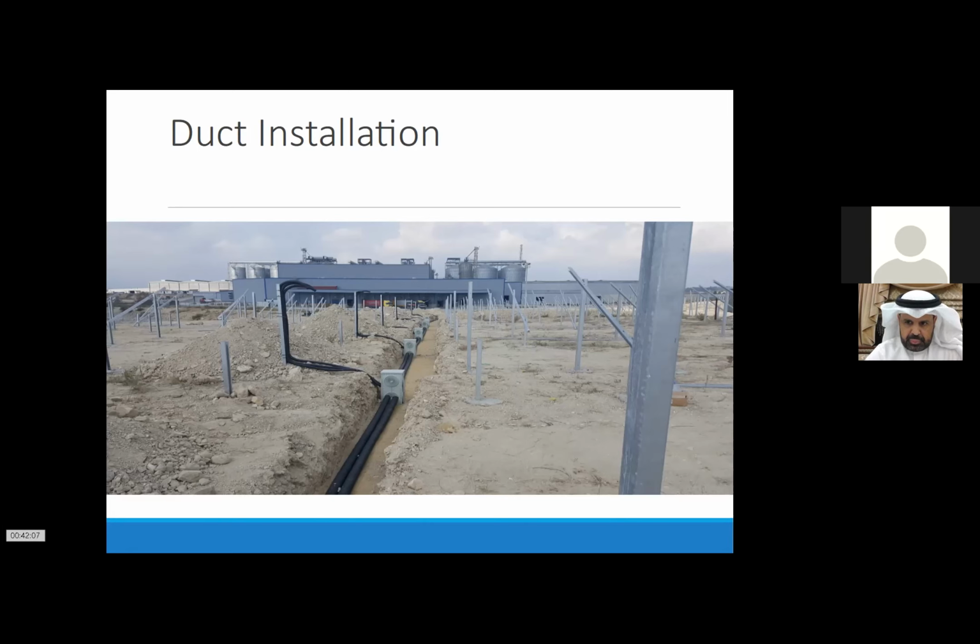So that's a similar question to the lady's with the shocking of the guy on the roof or on a ground-mounted system. That is potentially when the earth resistance is very high. That's why I always say make a soil connection, but a normal earth rod, depending on the soil, sand, stones, clay, is between 25 ohm and 100 ohm, and sometimes even more. This earth is completely useless. It is only going to help for a lightning strike where the surge arrestor ignites and it goes straight down to the soil. That has to be within 1 meter.